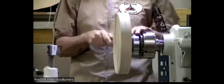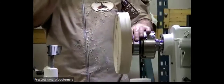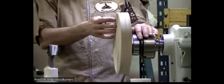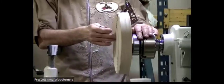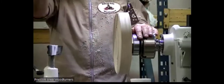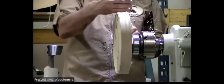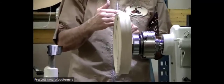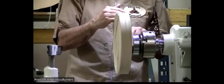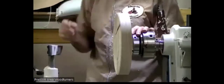That's one of the reasons I got it — you can make a homemade chuck. John Armstrong demoed this several years back on how to do an off-center using a homemade chuck. The biggest problem, as was just pointed out, is you've got to really mark it so that if you need to go back to zero, you know where that zero point is. On this one, you just take the number back to zero.